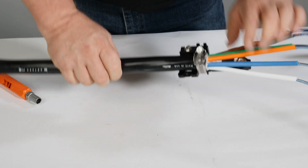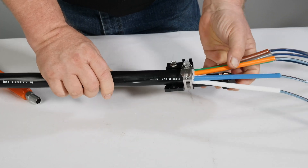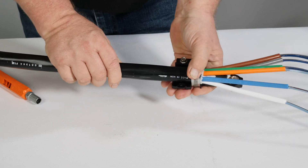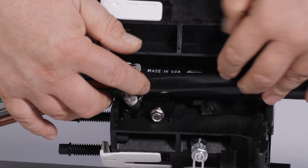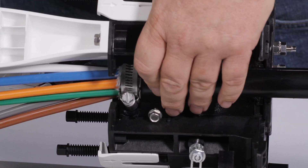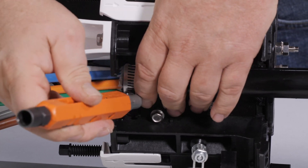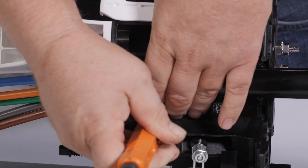Guide the cable attachment unit into the base and route the fiber to the basket opening, being careful that the fiber is not pinched. Lower the cable attachment unit onto its base alignment tab. Make sure the cable attachment unit retention bolt is properly seated with the hose clamp tail retained in the proper position, then tighten with a can wrench.